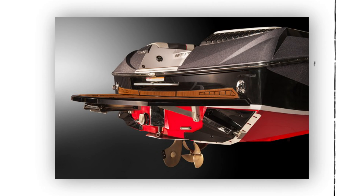As other companies came in, they couldn't copy Malibu because the design is patented. To use a similar design without copyright infringement, you need at least three major changes from the original design. That's why a lot of other systems, instead of going out, actually go down. This is the Nautique Surf System, or NSS — instead of a wing that sticks out, they have a little tab that extends out and down. We've discovered that having the wave go down and sideways helps because as the water gets forced back up, it actually makes the wave taller without needing a lot of ballast.